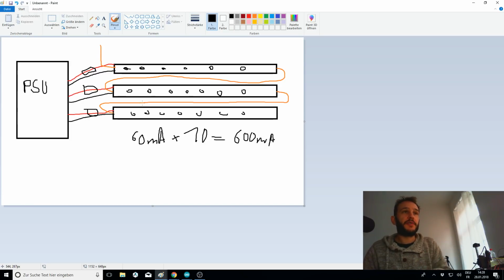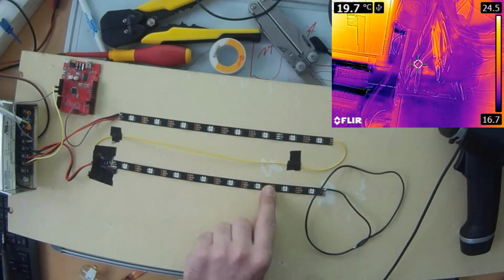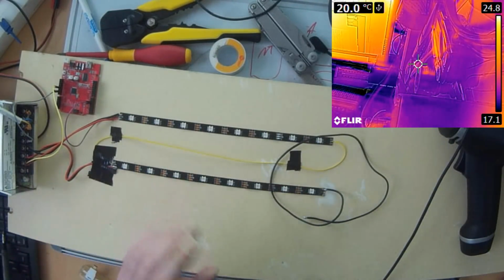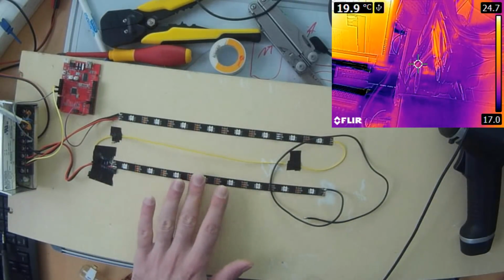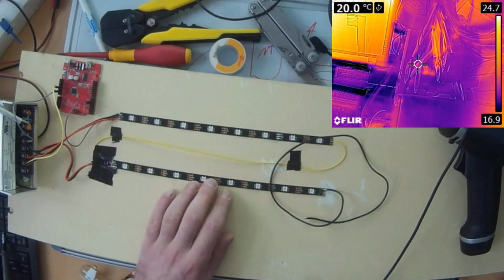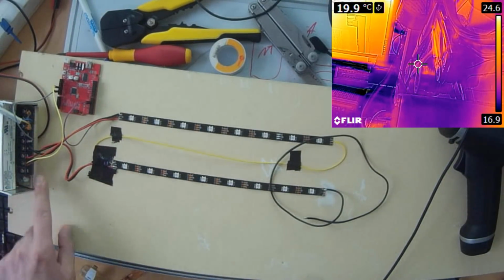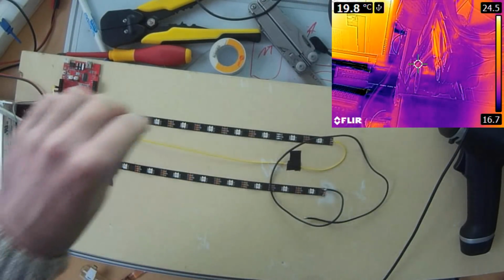And you always have to be sure to use these fuses, otherwise you have a big risk of getting the problem that I've just shown here. Because one solder drop here or a loose cable connection, because you've moved it around for your venues, can cause this big issue, and you have a high risk of fire. So always add fuses to your power lines, and also always use big cables coming from the PSU, and then split up the cables to the fuse and then to the strip.